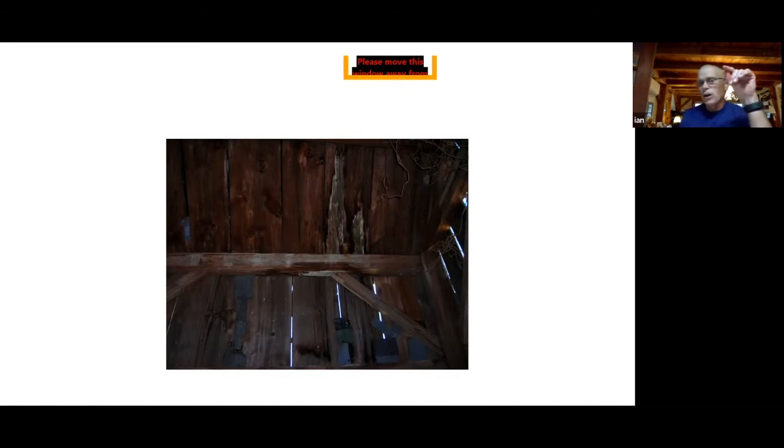This is that first barn, which had foundation problems visible from the movement in the roof line and from stones that had fallen out. The first floor was basically rotted away. The roof is a major issue in this barn. People always ask if you can phase the repair of a barn — when the roof is this bad, you have to do something about it soon, but you can't permanently repair the roof until you repair the rest of the barn.